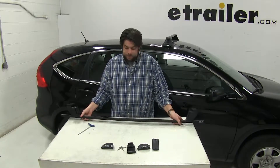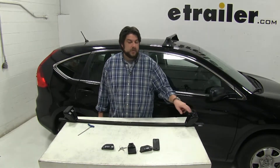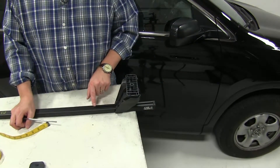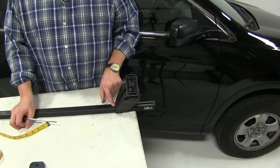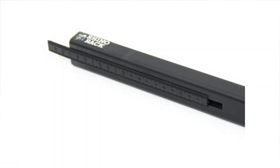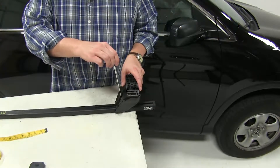We'll flip it upside down, then we'll install our fit kit onto our other leg. Before we do that, one thing we have to make sure of is the measurement between this edge here and our leg. You'll find this measurement in the instructions, and normally you would have a strip that you would cut into place and keep it in line. However, for demonstration purposes, we'll just measure it out.